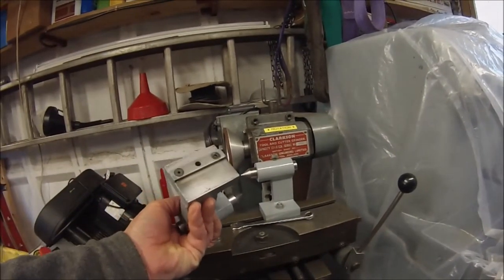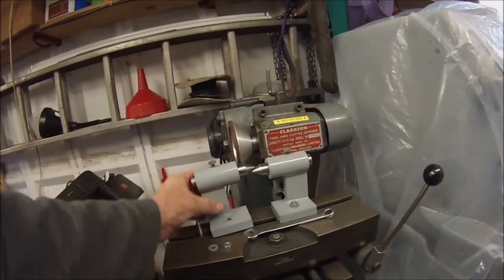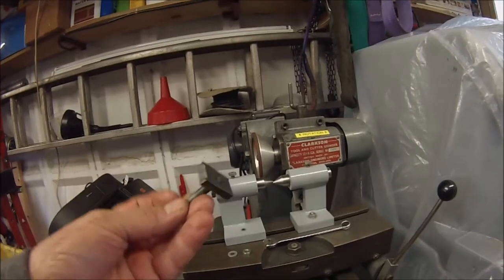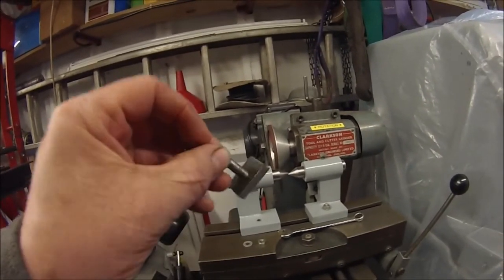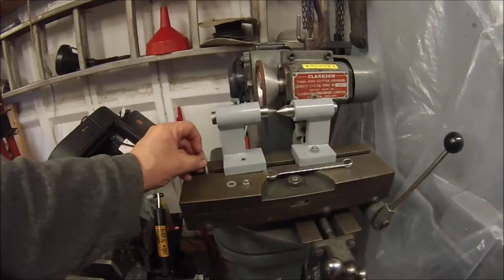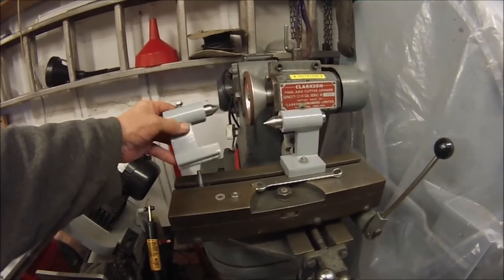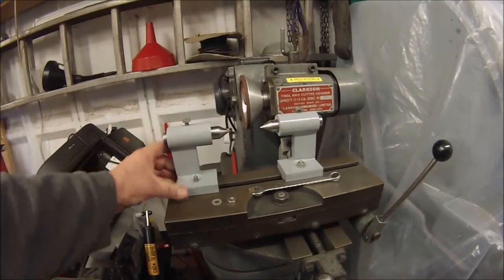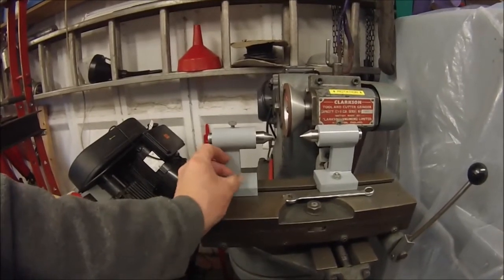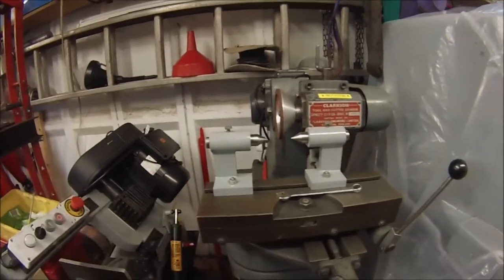There's our underside bits with our T slots in, T keyway in, that's the word I'm looking for. And that's simple enough. It's just a little piece of bar with a thread in it, and they're just Loctited in, just quarter BSF again. They slide nicely in the T slots. There's a little bit of clearance on them, and get that in one-handed. There we go. Just a washer. And there we have it. So that's another one done.